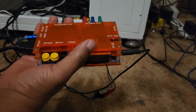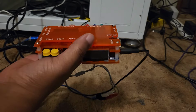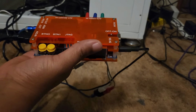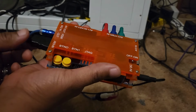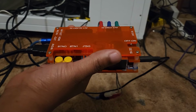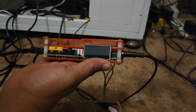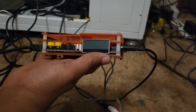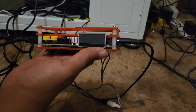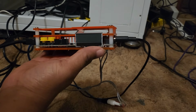So basically in this example, we are bypassing the Jamma system that's inside the arcade machine, and we are creating our own Jamma from the parts we have down here with the super gun. The other end of this HDMI cable is plugged into the HDMI port of your monitor inside your arcade machine. Now that should be all the connections we have to make. So what I'm going to do now is put everything neatly inside the machines, clean up this mess a little bit, and then we're ready to turn everything on. I'll be back. All right, so let's do that.